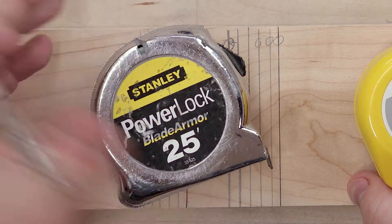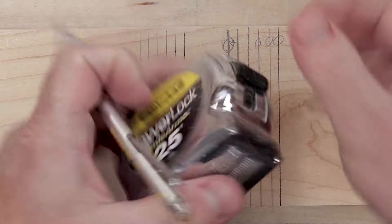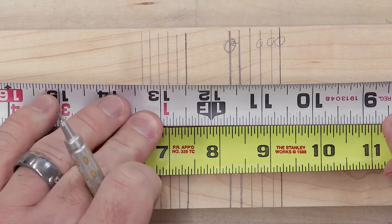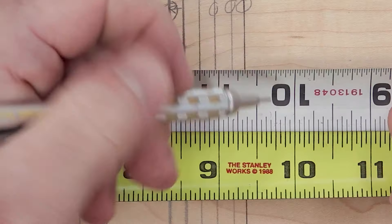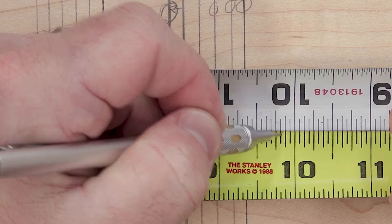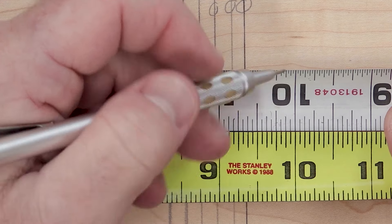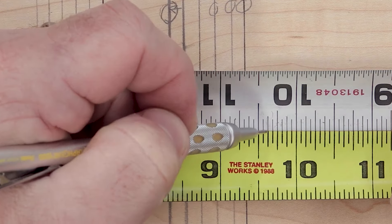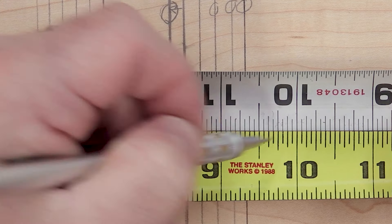What I have here is a Stanley 25-foot construction-type tape measure and my new go-to, the Tajima 16-foot. I want to show you the difference between the actual markings and increments on them — not whether the increments match, just looking at the lines themselves. As you can see with the Tajima, we have much narrower lines. The inch marks and half-inch marks appear similar, but the increments on the 32nds and 16ths are much narrower. The narrower we get this line, and the narrower our marking tool, the closer to an accurate mark we're going to get.